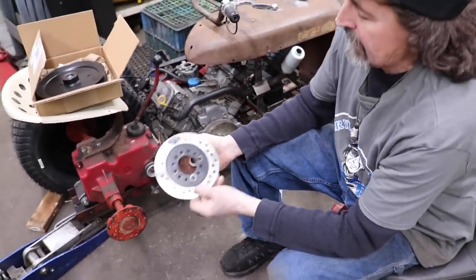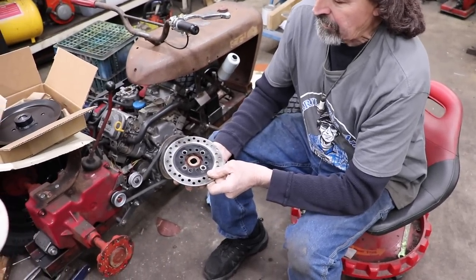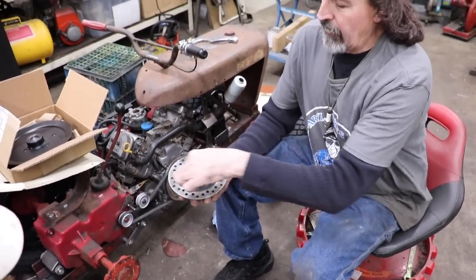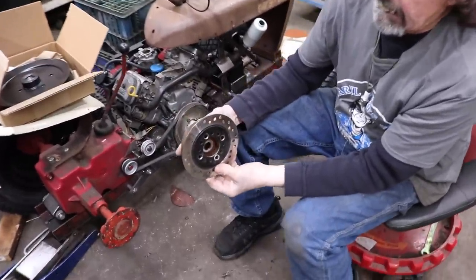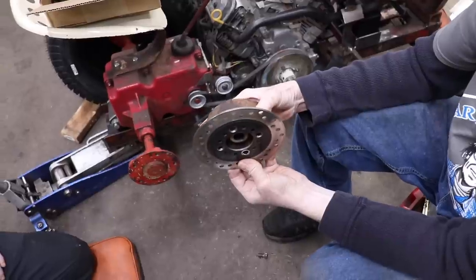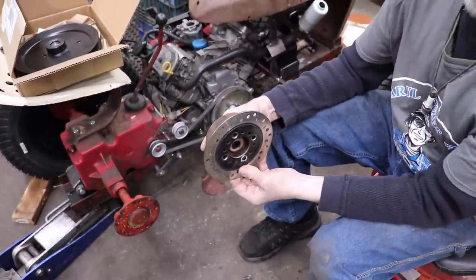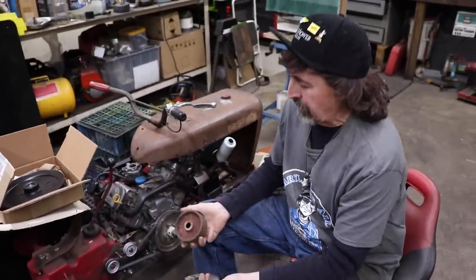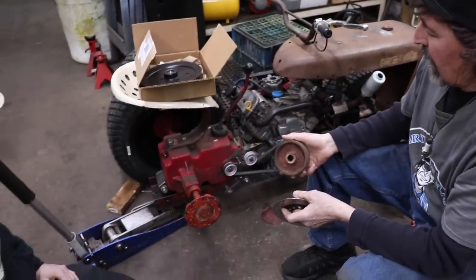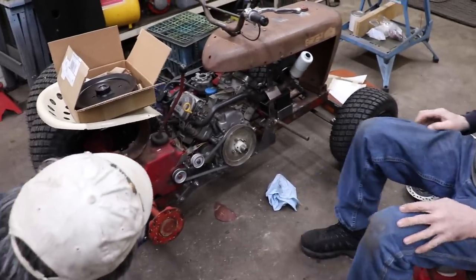we'll make a spacer and then we'll put this disc on the spacer and then we can drill through it and tap it. We could tap this and bolt this disc to this existing drum, and then we'll just have to make a bracket for the caliper and we'll go back to that existing VMC hydraulic brake system so we can make this thing stop a lot faster. Good. Those other brakes weren't really working out at all.